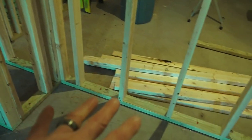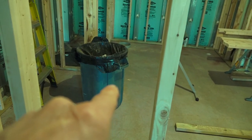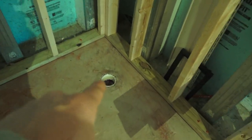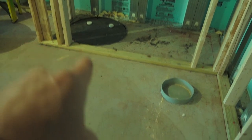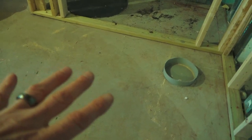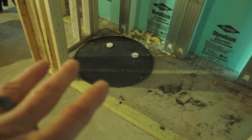We're also going to be jacking from the new bathroom location all the way over, and we're going to pick up the original toilet line under the concrete floor from the original builder's bathroom configuration. You get the three-inch toilet line right here from the original builder's location running underneath the floor right over to the pit. So we're going to find this pipe going from here over to the pit underneath the concrete floor. We'll cut a patch where we figure it's going to be, jack it out, find the pipe, and then jack straight over to the new toilet location and tie it in. By doing that, we don't have to dig a new sewage ejector pit.